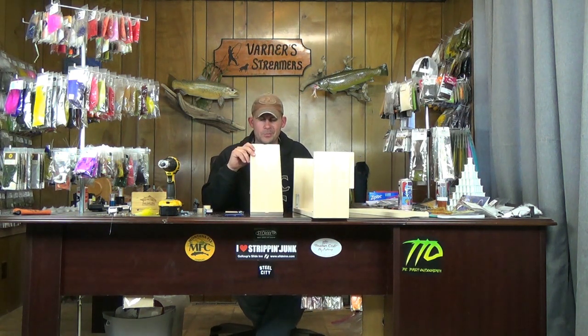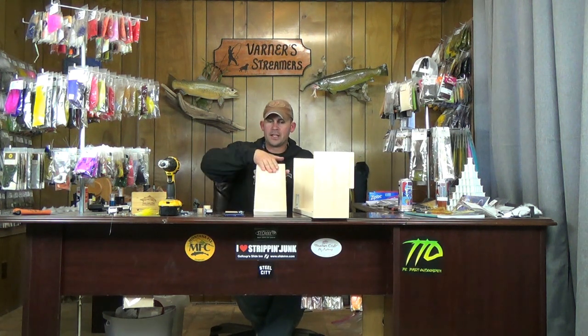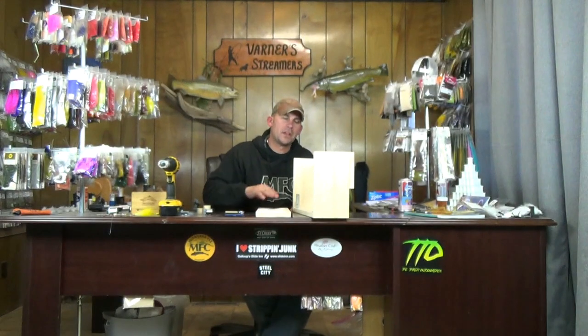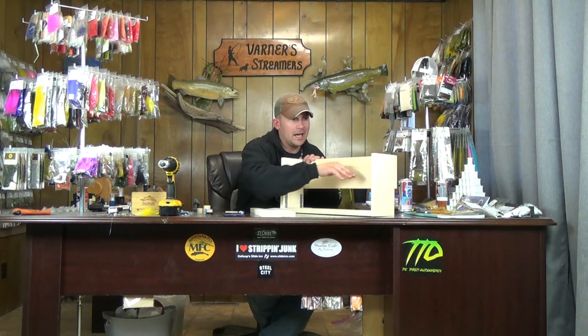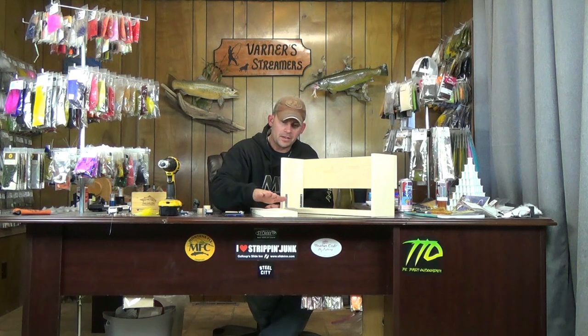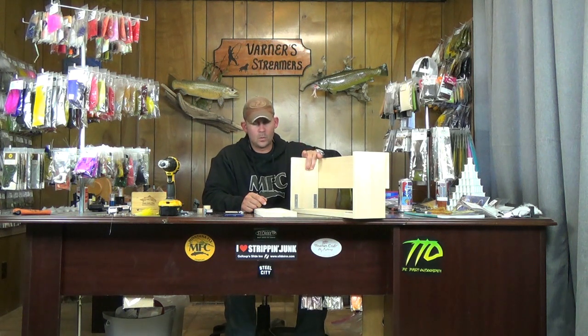What I did on this side was take a half-inch chisel and work it through here — probably a quarter of an inch deep — just took it in a nice straight line all the way through. Then I took a palm sander and leveled that out so when everything sits here the hinge portion is flush with both eyes. That bevel I cut into this is going to allow me to put material in there so it's nice and even when I'm working with it.